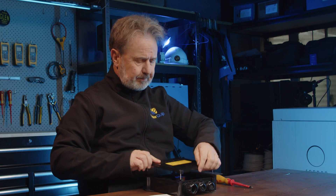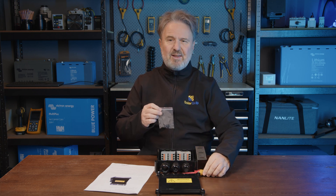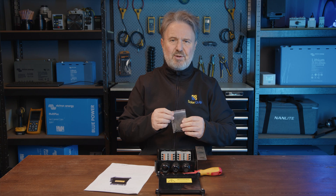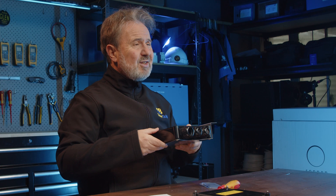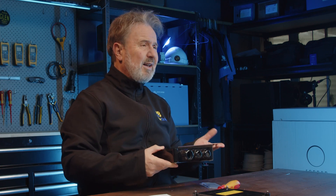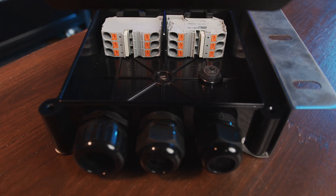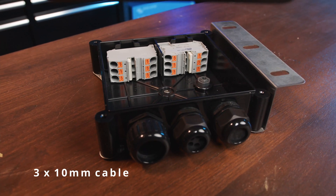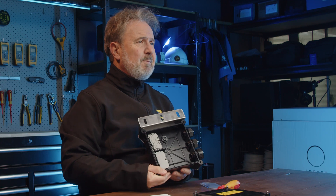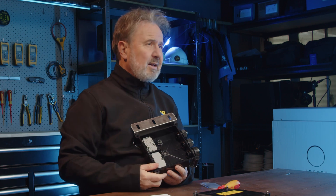Now inside here, we've got some pips to fill in the little holes above your screws just to make sure that they don't corrode sitting underneath the module. Another thing about this unit is the slim design — it's actually very thin, and so it's designed to go underneath a module or on a rail out of direct sunlight. We've got some terminal blocks in here which will take up to 10mm cable, so we can bring 10mm cable positive and negative and combine them at this point here. So all of your DC connections are done on the roof, other than the cable run back to the inverter.